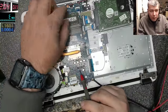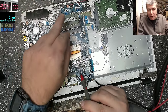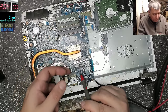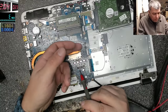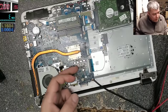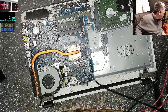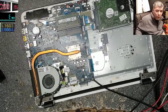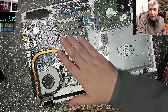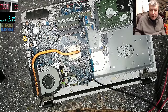Let's take out the RAM memory. Oh no, I'm not stupid. I was thinking that the RAM power supply is shorted and my circuit actually gets closed through the RAM, but it's not, it's something else. Okay, that's bad, the processor is getting warm. That's bad. Give me 1 second. That's proper bad. So actually the resistance is, it's a MOSFET. Okay, give me 1 second, 1 second.